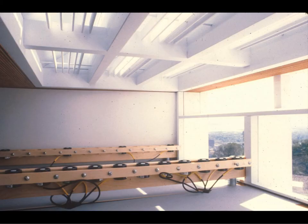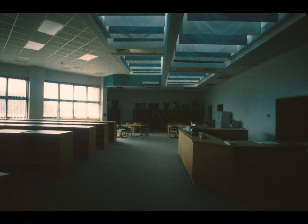Here's an example of what not to do: don't design baffles that need to be as white and reflective as possible and then start putting dark colors on them. This aperture system is supposed to be working correctly but instead it's not working at all, or very poorly. Beware of interior designers — they typically have no training in daylighting and don't understand the need for bright reflective surfaces. Many are strongly inclined toward dark surfaces, so if you've got a daylighting system, make sure that either you do the interior design yourself or you have someone who understands the overall daylighting philosophy.